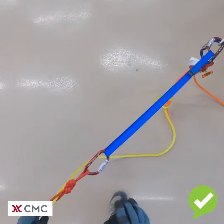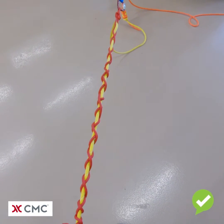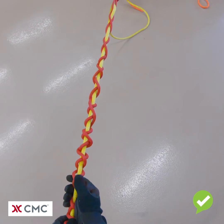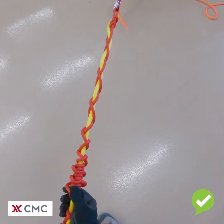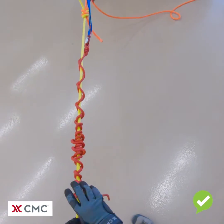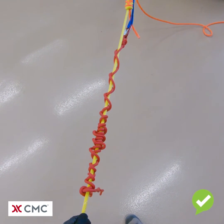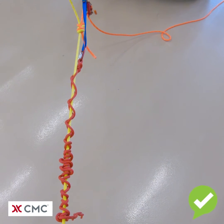System check. Now we can come back and push the dog and tails towards the MPD and release the load back onto it — nice and slow so it's a steady lower. Now the load is back on the MPD and we can safely remove the dog and tails and continue on with our lowering with the MPD.